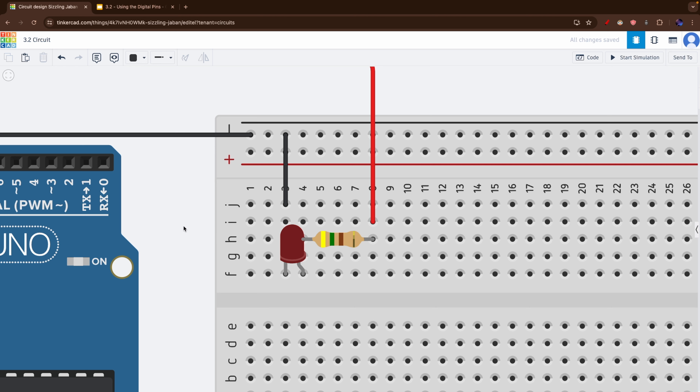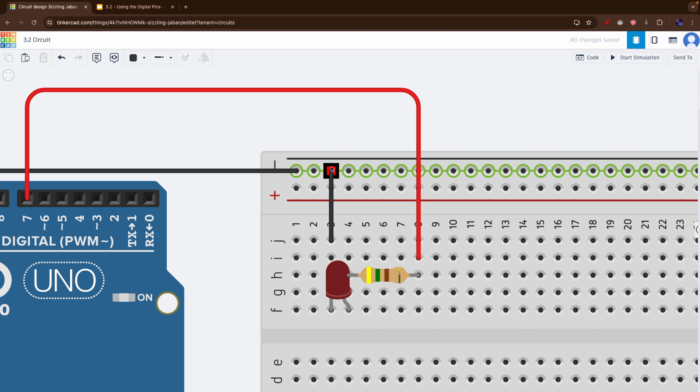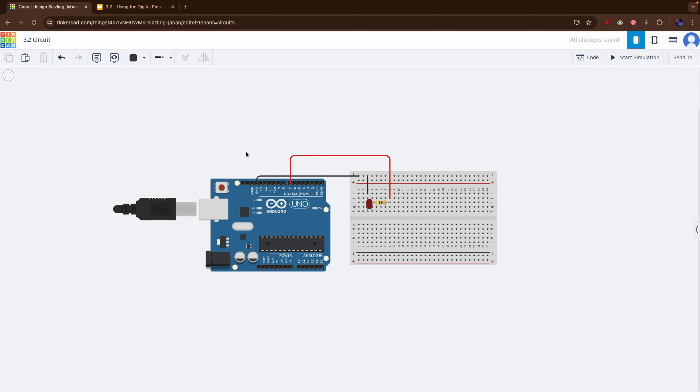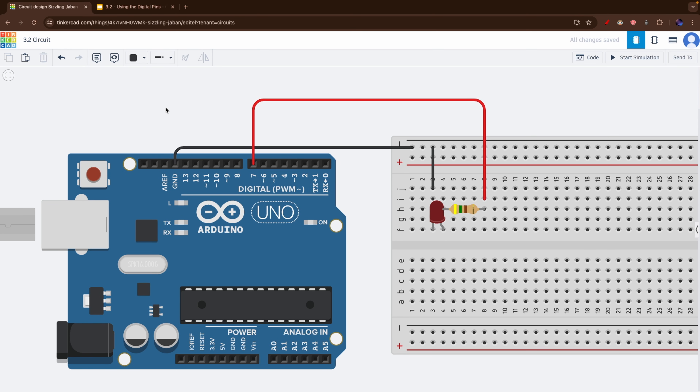Ask yourself: where is this coming from? For the cathode end, this wire is connected to ground, which is coming from the ground extension from the Arduino. All of these pins are ground, so if I take one of these ground pins and extend it here, now this entire column is ground, which means the cathode will get the ground connection. Same idea for the anode column — the resistor is going to have the same connection as the wire going to digital pin 7. So this entire column is affiliated with that pin, which means the anode is going to connect to digital pin 7. Thanks so much for watching, and I look forward to seeing you in the next video where we start to talk about how we write code for this LED.